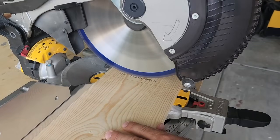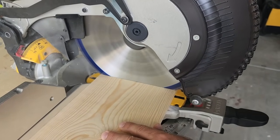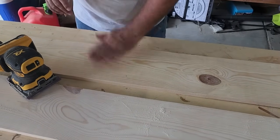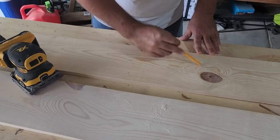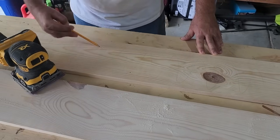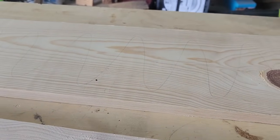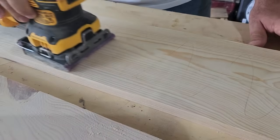I'd like to use my miter saw, but you can use a jigsaw or a skill saw — either way will work as long as you get a good cut. Let me teach you a secret about sanding: take a pencil and, without making too hard of a mark, put squiggly lines all across your board. That's going to let you know that you've sanded the board enough to stain it. The wood that comes right from a hardware store usually can't just be stained right away.